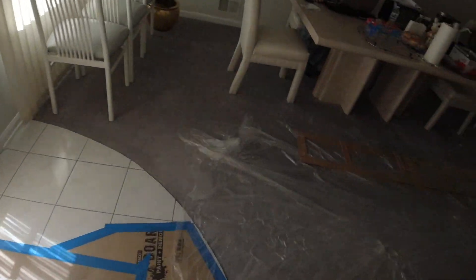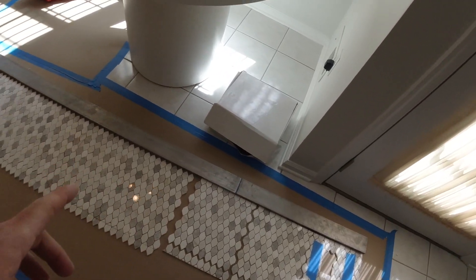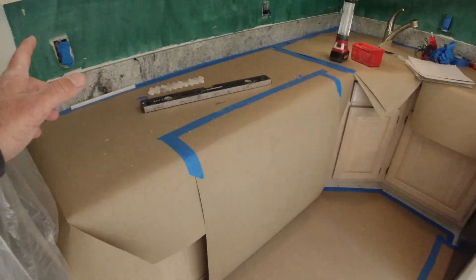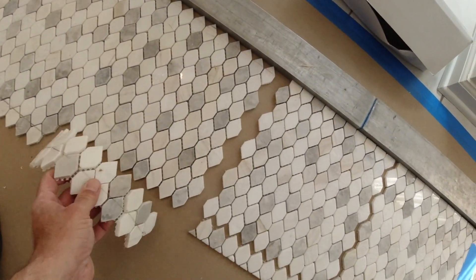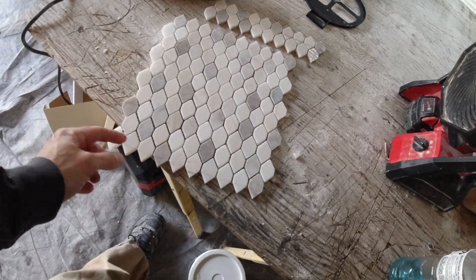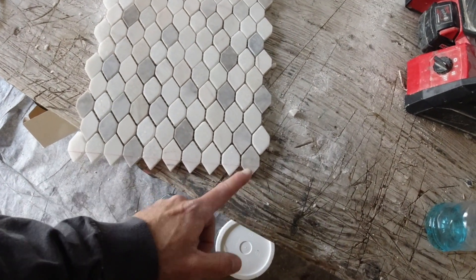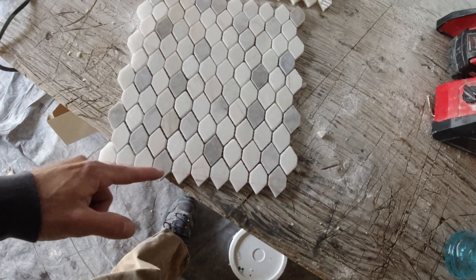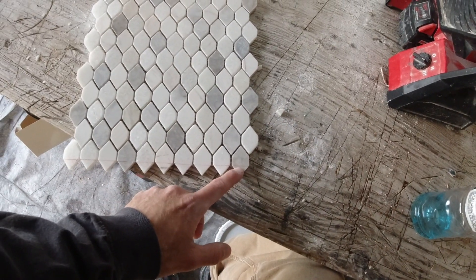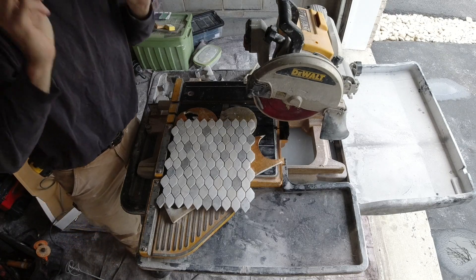I got everything templated. Make sure to put the template right over here — all hot glued together, got everything marked out. I'm basically cutting them and putting them back where they need to be, so I know exactly how I can take them off and put them right on the wall. I did the first piece, tested it out, make sure it's fitting good. I'm going to do basically one row at a time. When I cut it, I put the template here and I mark through it with my pencil. For the thickness of the pencil I want to take that out, so I'm going to put the blade right on the line — not up to it, but right on it. If I go up to it, the piece will be a little bit too big, because when you put your template on and mark it, the thickness of the pencil is going to make it bigger. So I want to take that line out. I'll show you how I do this cut now.